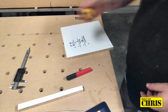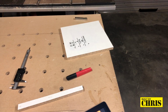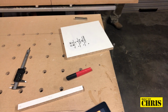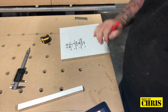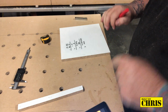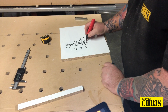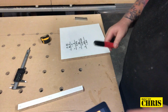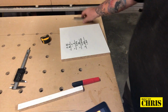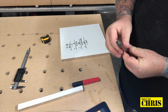So bear with me just a sec and I'll go and measure those up. Okay, that distance is 1020. So multiplied by 1020 gives me 1.3510. That's the distance I'm out over the distance. So I'll set myself up again. I'll get my feeler gauges out right here. I'll set up 1.351 or nearest to, and we'll try again.